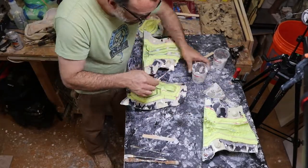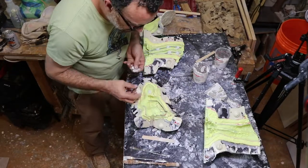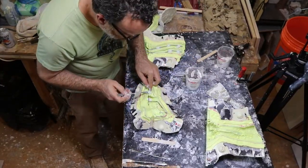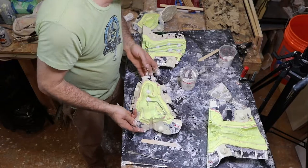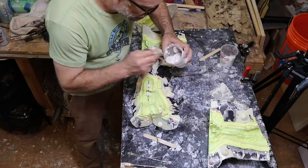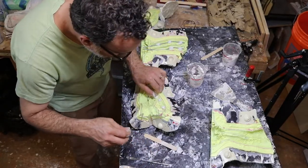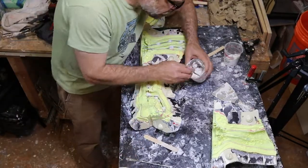Here I am casting plaster into a four-piece silicone rubber and plasti-paste mold. I'm using Puritan pottery plaster and I've got some aluminum all-thread, making some little stanchions basically to hold the all-thread in place inside the mold to strengthen those parts — the neck, the arm, the legs. You just have to put metal into one side of each part of the mold.